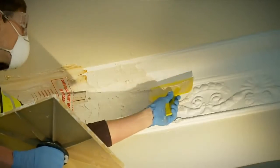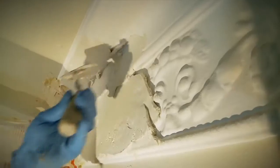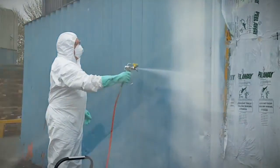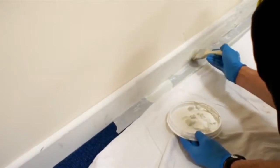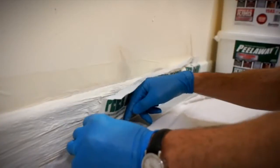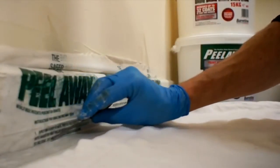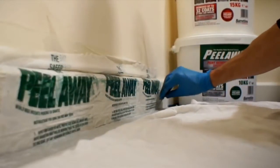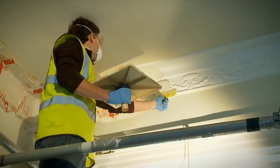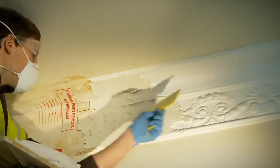Both products can be applied with a spatula included in each pack, brush, hawk and trowel, or specialist spray equipment. Apply to the thickness determined by your test patches, covering a manageable area at a time. As you apply Peel-A-Way, you must pause to apply the special cover that comes with each product. To simplify the cleaning up process, as the product completes reacting with the paint, it will dry back onto the blanket, leaving only a residue on the surface to be washed off. It is important that you apply as much product as you are able to easily remove at the end of the stripping time, and regular checking is needed to see how the stripping process is progressing.